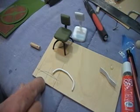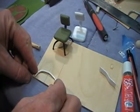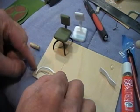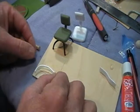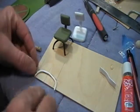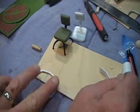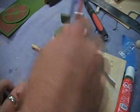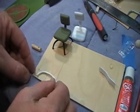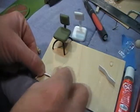Come off seven-eighths inches from the center. What we're going to do is take our piece of resin and pull the leg to where the center line of the bottom leg is at the center of that line. This allows the resin piece to be flush at the bottom, and then we're going to trace along that on the back side. We'll lay it back on there and make a mark on the resin.